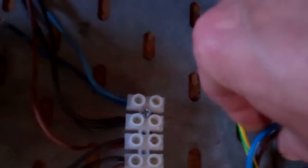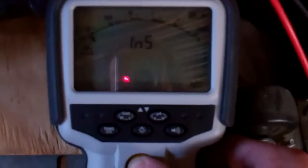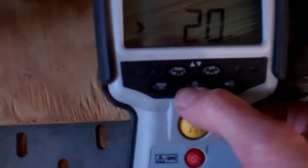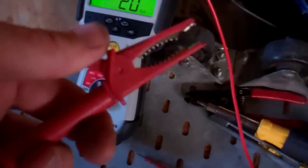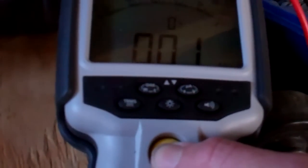So what I would do is take my two feeds out. Obviously you've got this isolated and the fuse is out, or disconnected or whatever. The fault could be on that cable, so once I've disconnected that I would probably check the cable. 20 giga ohms there — so that's well over. We've got a little crocodile clip on there where you can pull that off and then you've got a test probe. Hit the test button again. Dead short.